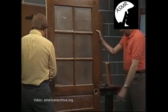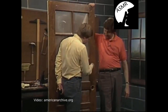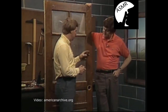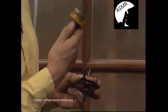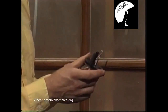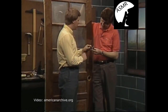There are a couple of ways to drill and a couple of drill bits on the market. You could drill with a regular bit and use a keyhole saw, but it's very difficult and not suggested for amateurs. Rather, go to the hardware store and buy a hole saw — this one is about $8, this adjustable one is about $3 or $4. The hole saw is 2 and 1/8 inches because that's the hole size required for the cylinder to fit in.